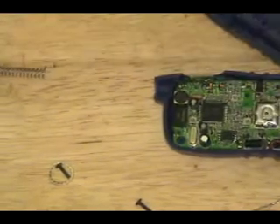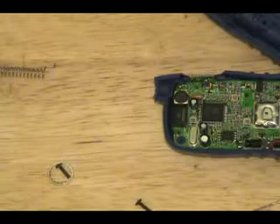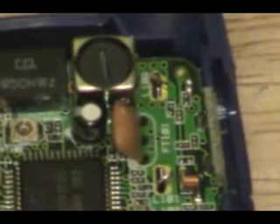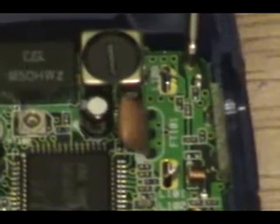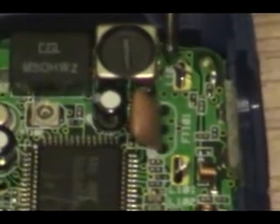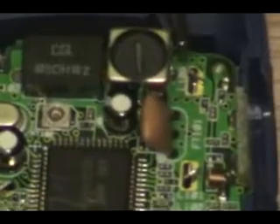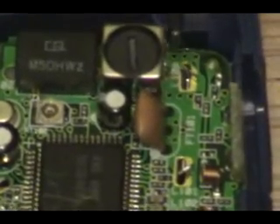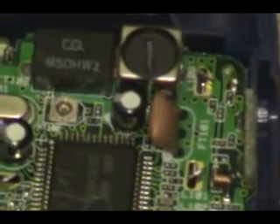There's a small little tab — let me get one of my multimeter probes in and zoom in real quick. There we go, that's much better. Now if you notice right here, this is actually the signal lead right there. It's a through-hole, so I'm going to route the wire through there. And this little tab right next to it is a ground point. Also, this box right here is a ground point, and you see there's three little holes here — also ground points. I've confirmed this with a continuity test on my multimeter.